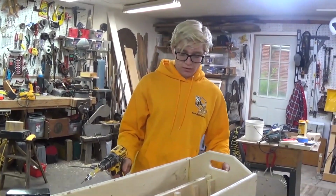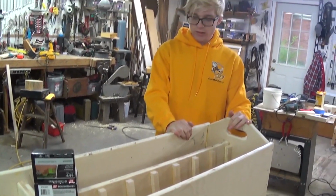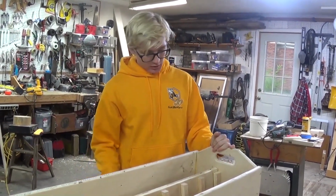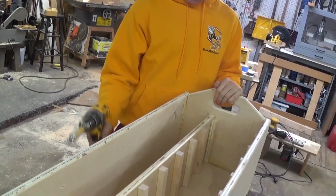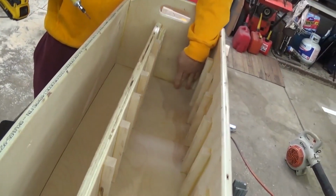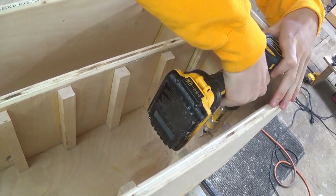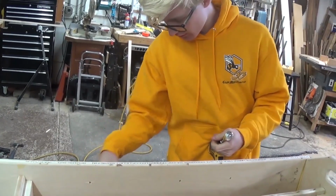So what we're going to do now, now that we have the entire battery cart put together, is make it more durable and structural by sinking some deck screws in the various parts of the cart. Where we're going to start is with these wheel blocks, the axle blocks, and first I'm just going to drill a pilot. I have my points already marked. And we're just putting 2 into the quarters of each axle block. Put my deck screws in. We're using 1 5/8 deck screws.